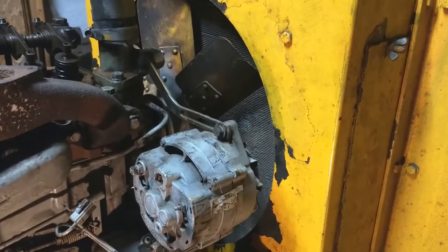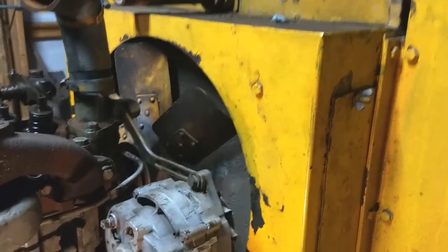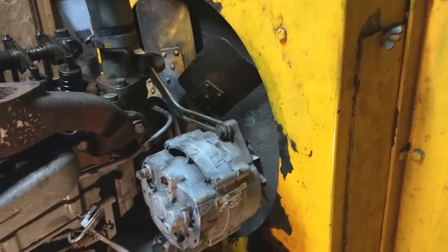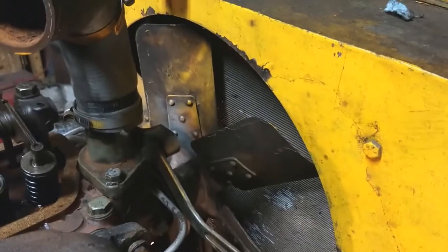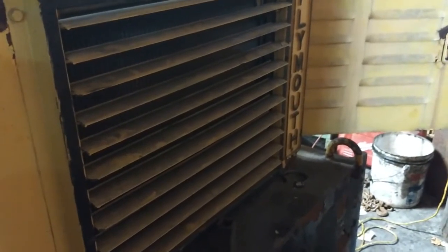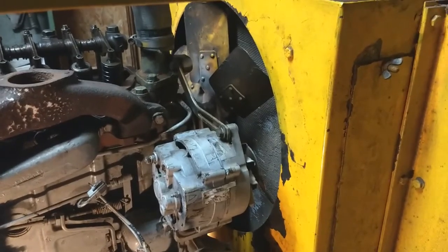An interesting quirk with this engine as configured for this application: if you note the rotation of the engine, the fan will blow air up through the radiator and oil cooler rather than the normal direction. Because this is meant for really high load on the hydraulic system, you need the oil cooler — it blows through that, comes through the front, and blows out the front of the radiator. I'm not sure if it was specced that way just for the munitions plant so it didn't suck any aerosolized dust into the motor and blow something up, but it's an interesting quirk.